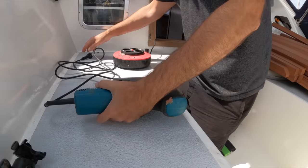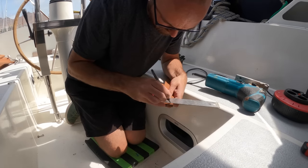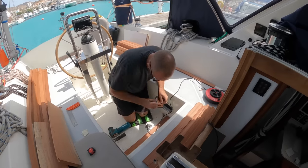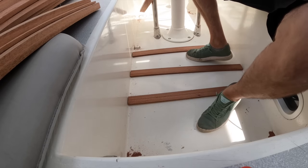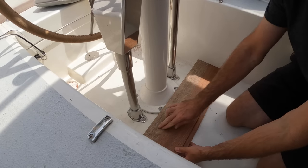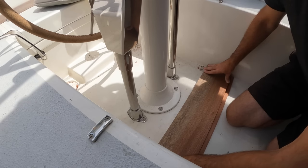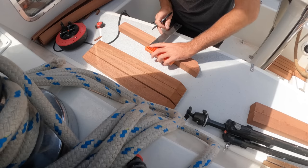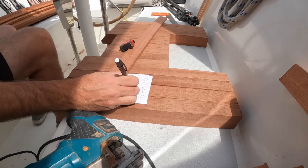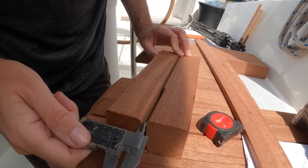I busted out all my tools and got set up in the cockpit. Sadly the only electrical saw I have aboard is a jigsaw — not exactly known for super straight cuts, but for this I think it'll be fine. I squared up all the ends and trimmed all the supports to length. I need to split the grate into two sections to be able to remove it. My first plan was to use pieces with a cutout for the steering pedestal, but the cockpit sole isn't flat and they were wobbling, so I changed my plan. The aft section seemed the trickiest so I decided to start there. After trimming all the pieces to length I busted out my trusty router and a round-over bit to round over the edges — the bit was a little more aggressive than I'd have liked but it's my only option.